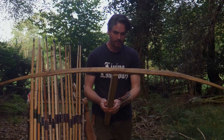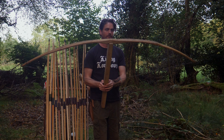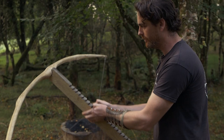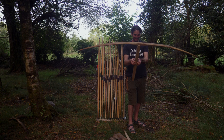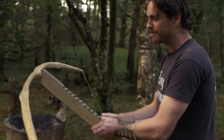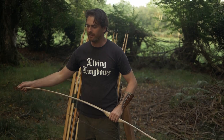There's bend here and here and a bit less bend to the tips, which is fine — that's a work in progress, but pretty nice and even at 20 inches. I also like to move it and see it bending — that exercises the fibers when you're tillering. The bend is nice and even, it's a good bit stronger at this draw length. The question is can I draw to full draw, or will I just damage it irreparably? So let's go and shoot them.